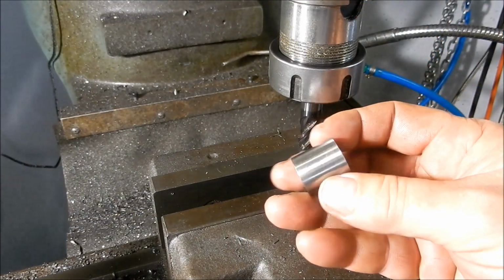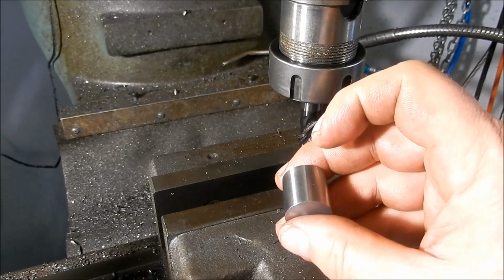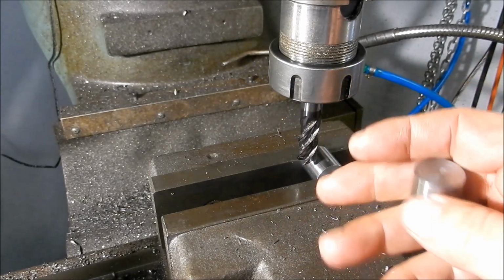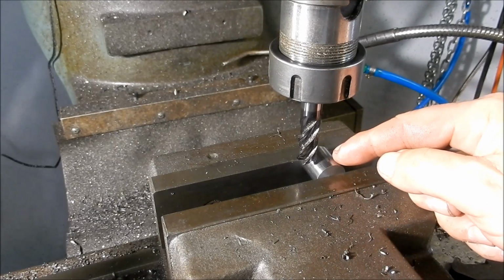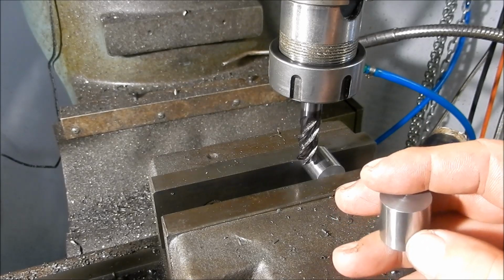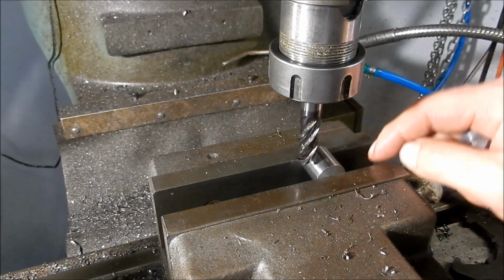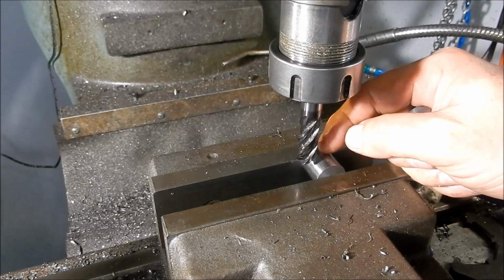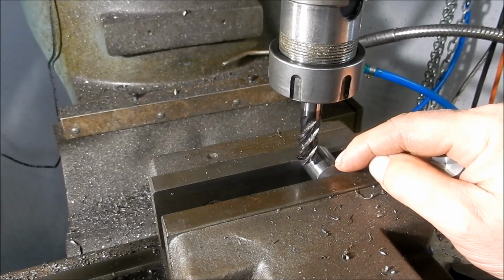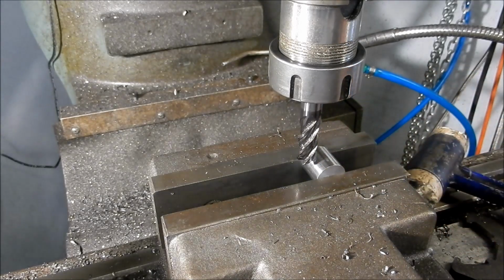All right, guys, we've got the short ones in. These are the ones that are going to have a 6mm hole drilled and reamed, and two flats on either side so we can fit the thrust washers on. And this is to allow the expand and collapse of the jaws of the cant twist vise. I'm going to use a 12mm end mill here to cut across, so that when I'm cutting those 6mm spigots on here, I'm not cutting intermittently. I can cut a full thread and just do a little touch up with a file just to take the burrs off the edges.